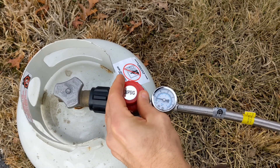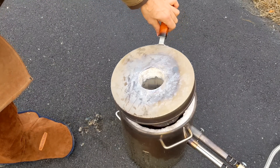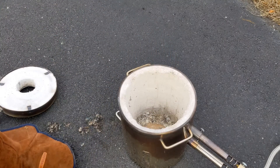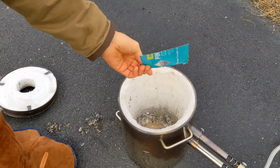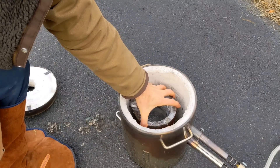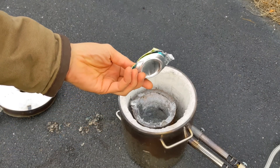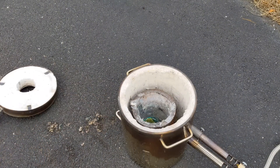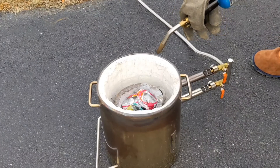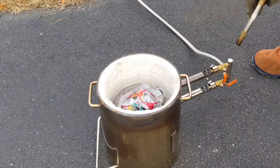When melting down aluminum cans you really need a larger crucible to do so, and throwing in the cans one by one does take a long time. So you can imagine if I had a smaller crucible it would have taken much longer. In the beginning I placed a piece of cardboard on the bottom between the crucible and the plinth — that is to help prevent the crucible from sticking to the plinth and help for easy removal. So let's fire up this furnace and start melting down some aluminum cans.